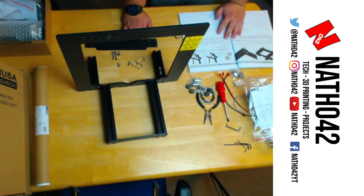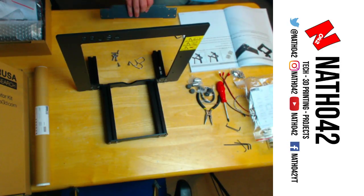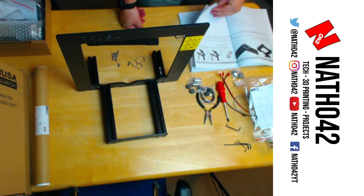This is a very important step. Incorrect placement of the PSU holders will lead to issues later. For the following step, please prepare PSU holders. Take the YZ frame and rotate it with shorter extrusion towards you. What? Oh, right, okay. Turn the whole unit around so the shorter extrusion is towards you. Place the power supply unit holders in the extrusion. Ensure it's the correct one. Okay, sure. The exact position of the PSU holders doesn't matter. We will adjust them later. Excellent.